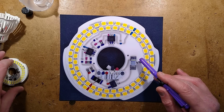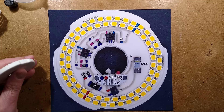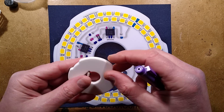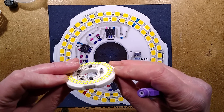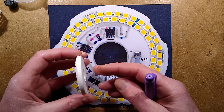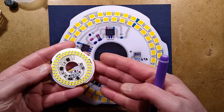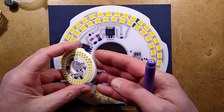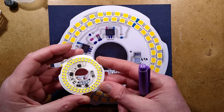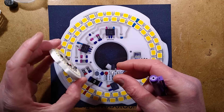The material itself — the ceramic — it's unusually thick. I wonder why they made it so thick. It would be better if I got a little bit closer, though it is quite big. Why did they go so thick? Is this for strength? Normally it's not the mass of a heat sink that matters — it's actually the surface area. But I'm guessing this is basically designed to facilitate taking the heat from the LEDs quickly and then give a decent surface area for it to dissipate. I'm surprised at the weight and thickness — this is a chunky, heavy piece of ceramic.